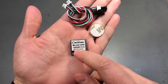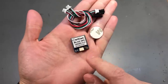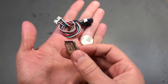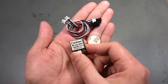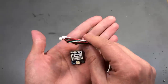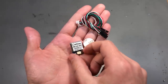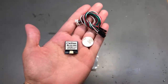I needed a new GPS module because I'm building a new RC plane, and this time I went for the BN220. I think last time I showed a GPS module it was the BN180. The BN220 shows better sensitivity in practice compared to the 180, so I went for the better one — but they're similarly priced and the 180 worked good enough. These usually ship with a short JST wire and a piece of double-sided tape for mounting. If you have any GPS tracking project in mind, they're pretty good for their cost. A link will be provided in the description.